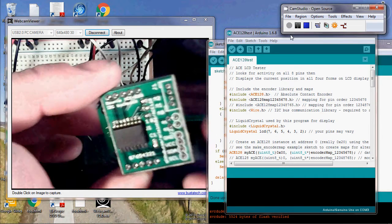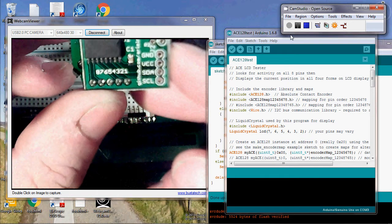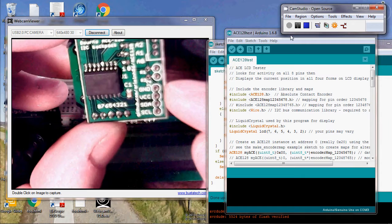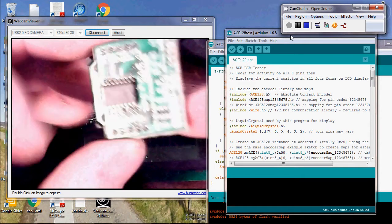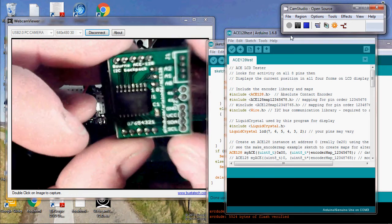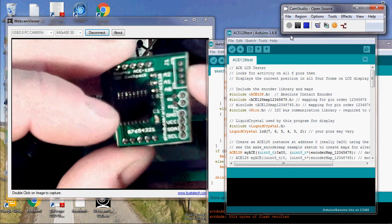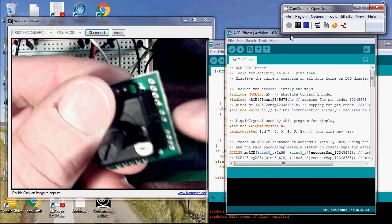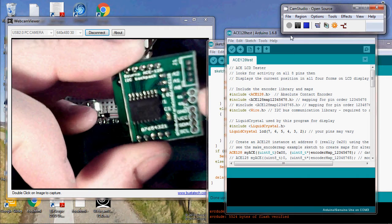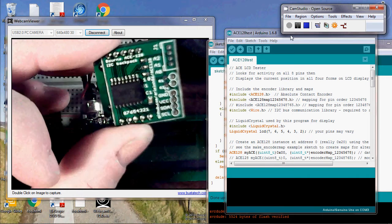There's a specific translation table that's used on this device: 8, 7, 6, 5, 4, 3, 2, 1. Other features of the board: we have our 0.1 inch I2C header here. There's enough space on either side to mount a locking header. There's also a mount here for a Grove connector if you're a Grove person, and that also can be put on either side. These holes here are for vertical mounting of through-hole resistors if you want to put your I2C termination on this device — all optional.